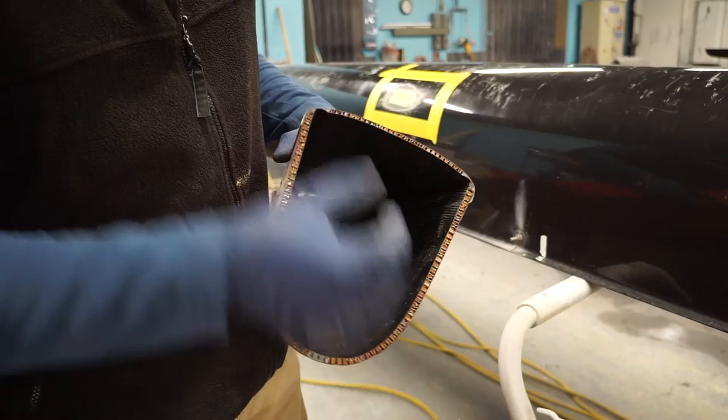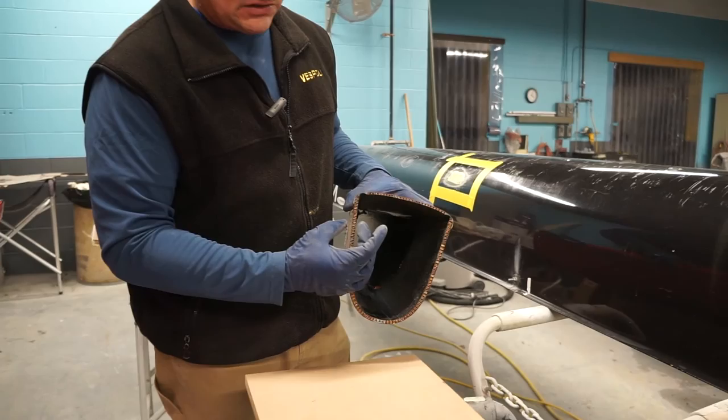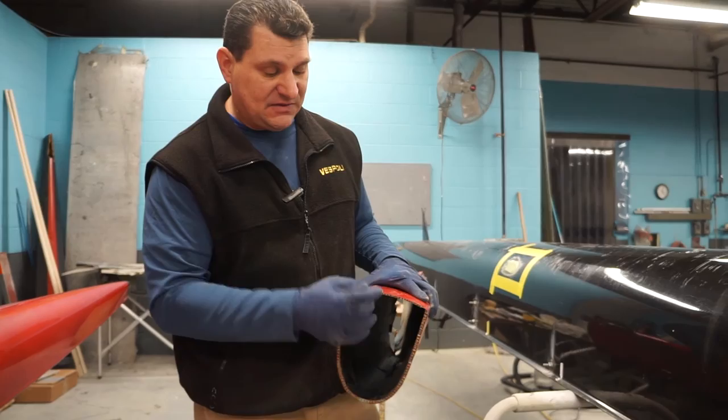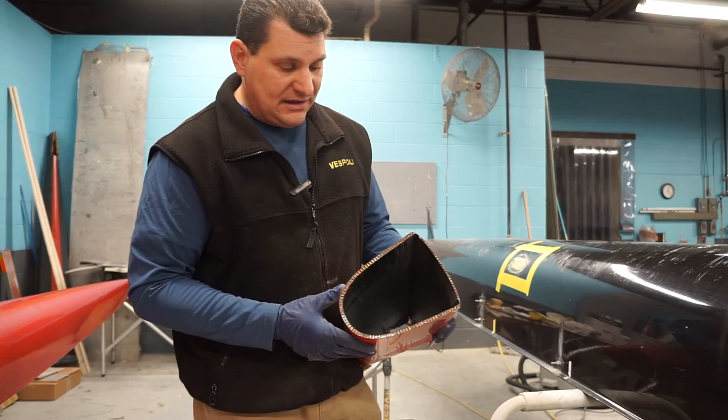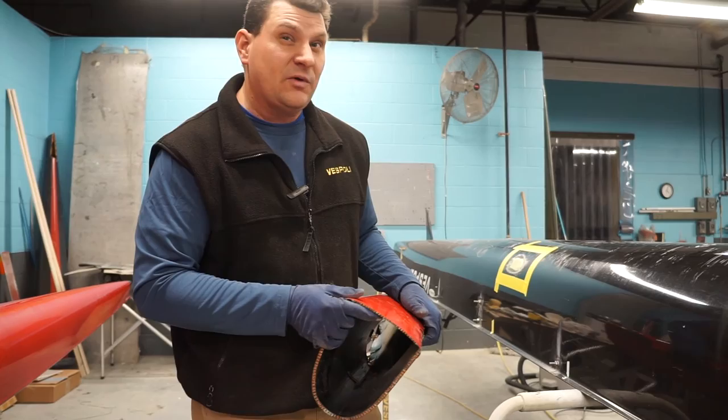Here we have our 5mm Nomex and this is a 3mm Nomex — see how thick our hull is? Some of our competition actually builds the entire hull out of this thinner Nomex, which can cause problems because it's less thickness. You don't get as much rigidity of the hull and it's much easier to crack. If you hit something, you can get a long crack running through the hull much easier than with a thicker hull. I've been doing this for 20 years and last time I tried to count, I got up to 26 different brands of boats I've pulled apart and worked on over the years.